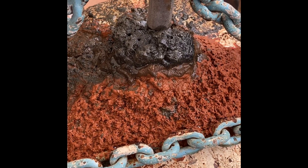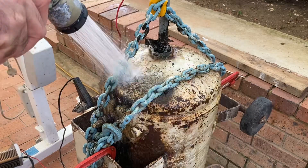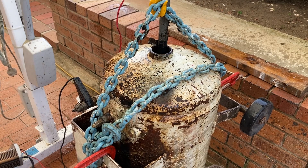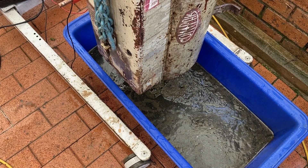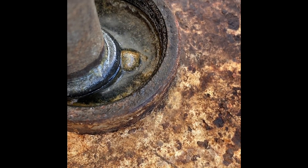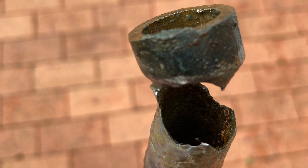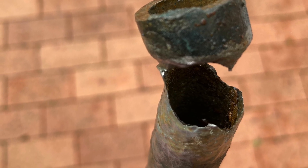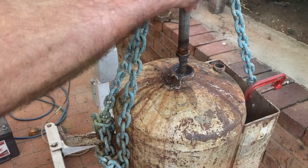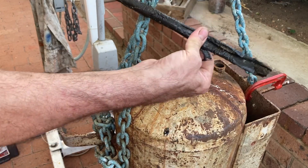It was running like this for about two days with rusty gunk coming out. At the end of two days it stopped producing the rusty colour and was producing this black gunky stuff. Every day or twice a day I would hose it off and top up the water in the tank. Finally, after about seven or eight days, it stopped bubbling — that could have been the electrolyte becoming too diluted. I switched it off and drained the tank. The pipe I was using is the anode, connected to the positive of the battery terminal. After a week, the electrolysis will chew right through that piece of pipe.